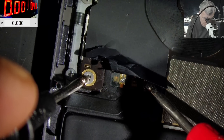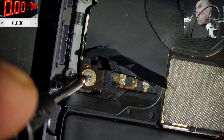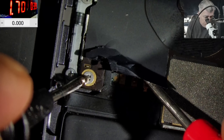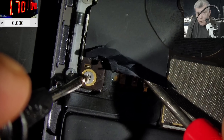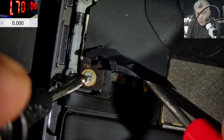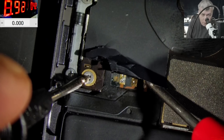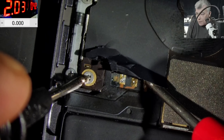Good. I'm going to raise the current a little bit — now 1.1 amps, let me raise it a bit more. We are pushing 1.7 amps onto the battery. The board is reset because the battery was at zero volts. We now have like 4 volts. Raising current further — the battery is now taking 2.2 amps. The current is going down because the max voltage I set is 4.2 volts, which is a fully charged lithium cell.